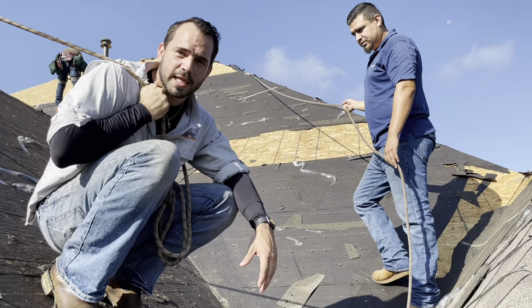So here's the Dead Valley. As you can see, a lot of water can pool up in here and it builds up before it can drain out, so water is able to build up and then go into the home. We're going to take all of this apart, take off this wood siding, remove this flashing and the metal pieces, redo all of it, and use what's called ice and water shield to wrap the valley and wrap up the side of the home. Put new flashing back in, put the siding back on, have everything perfectly sealed and take care of the problem.